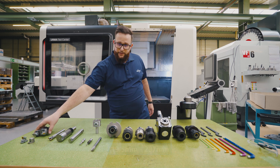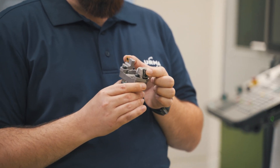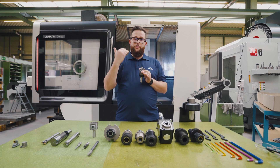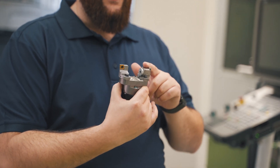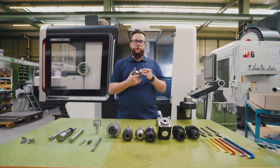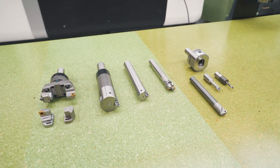The gamma Intramax can be used as a double cutter for double roughing. It can be used for offset roughing to reduce your spindle load and to have more depth of cut. You can run the configuration you see here, which is roughing and finishing in one shot. You can even change the insert holders and put in special inserts to make face grooves. The very versatile gamma line is also suitable for turning machines.